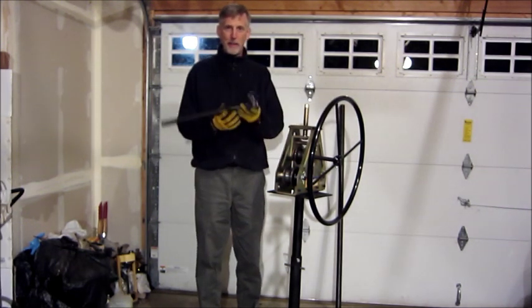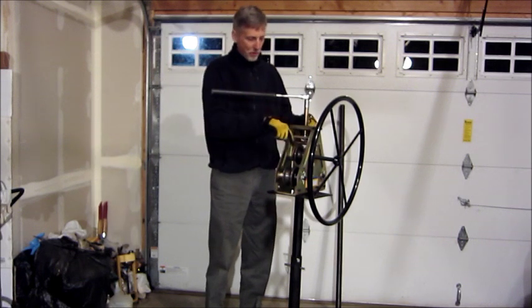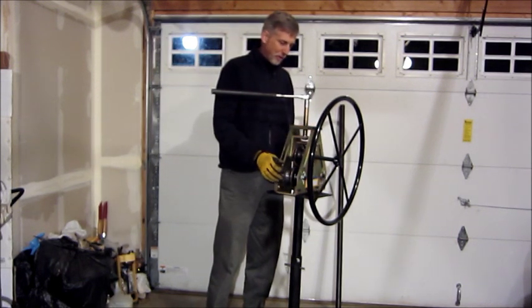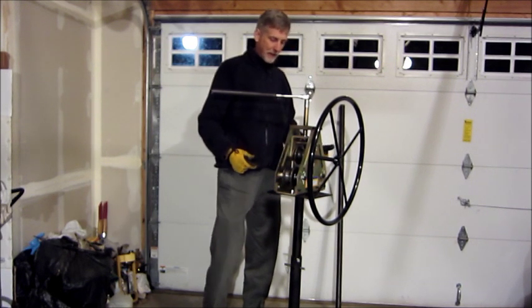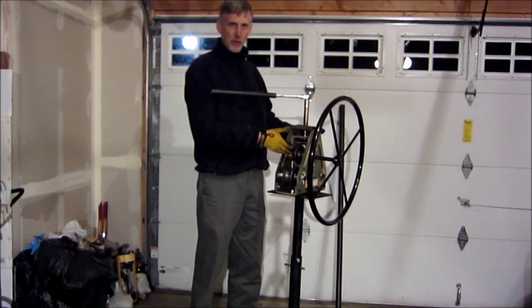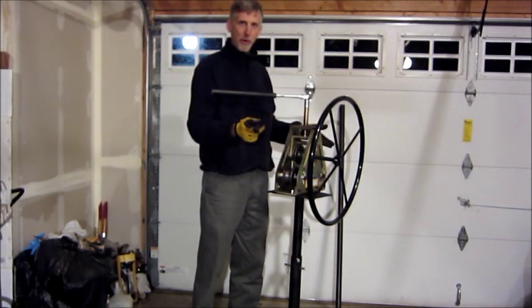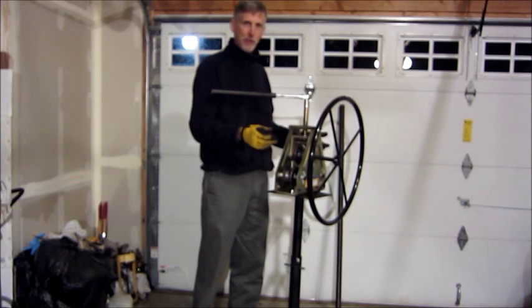I have a large wrench on the top to make it easier to push the bolt down. The tubing roller has three rollers — you put the tube in through there, tighten down the top roller to put pressure on the tube, then roll the tube back and forth, which gradually puts a bend in it.